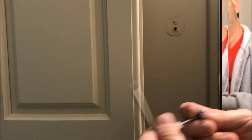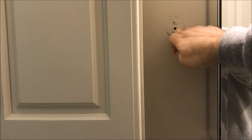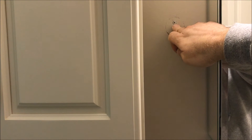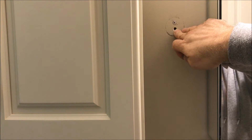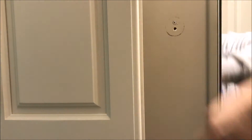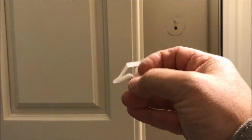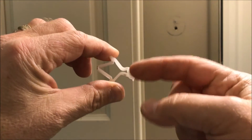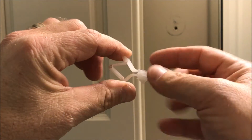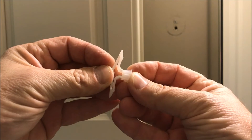Plan B will require a little bit larger anchor, and I've got them out there. The top one's fine — it's nice and tight — but if I don't have one that's large enough for the bottom, I'll go to a toggle bolt, but one way or another we're going to get this secured to the wall. I went back out to the shop and found this anchor: you press it like this, force it into the wall, and the screw will go through the anchor, catch on the end, and draw it up, flattening it out and giving you a nice tight grip on the wall.